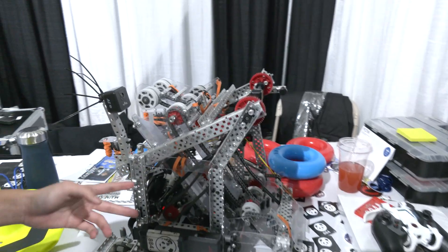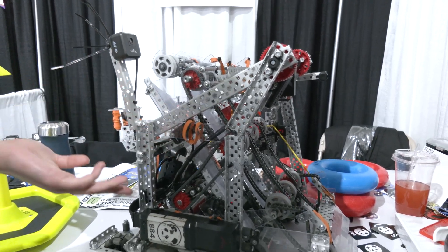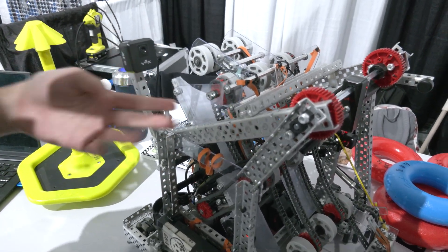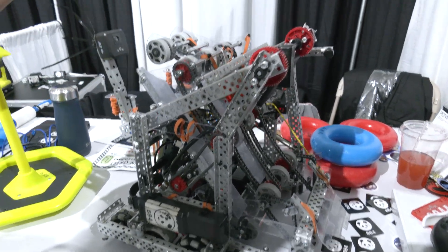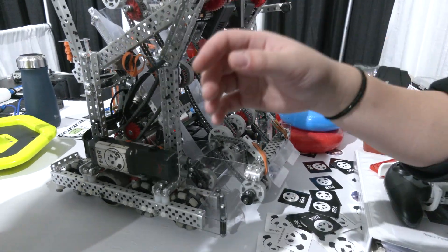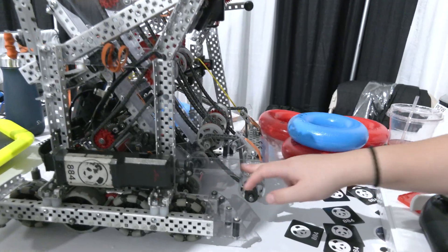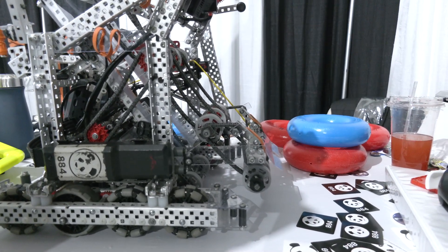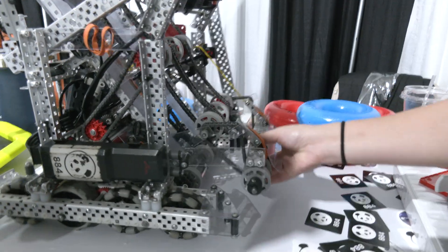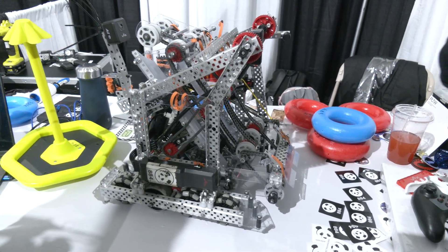I want to talk about polycarb again. We actually use polycarb in a lot of our structural aspects, which you don't see too often. Polycarb is very hard to shatter and very lightweight, so we're able to replace a lot of metal. On areas like our intake, we have almost entirely polycarb — we know it doesn't need super strong structure, so why not minimize weight? To add on: our whole arm is polycarb. It has a lot of give — when we previously had C-channel arms, they would bend. But our polycarb arms always spring back to the same spot, making them a lot more robust.